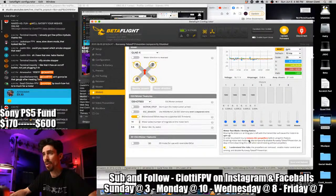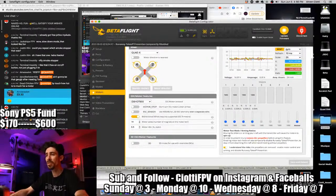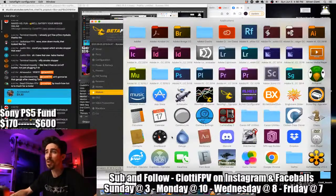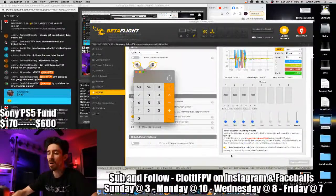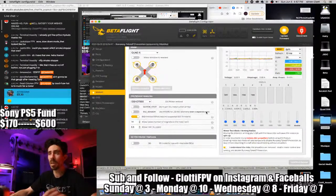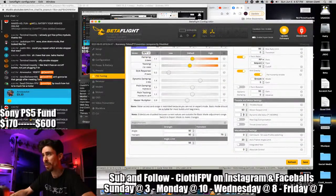All right, so what was that number? 5,100? If you need to figure it out again, just ramp the throttle up to 1055 again. 5,100. Okay, so 51. So here's how you do the maths. Let's get this battery unplugged. 5,100, you drop the last two zeros, so you just have 51. You take 51, you multiply it by 0.8 to get 80% of it, and you come up with 40.8, let's call it 40. We come in here, and that is what we're gonna use for our dynamic idle.